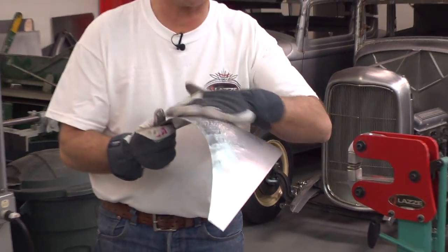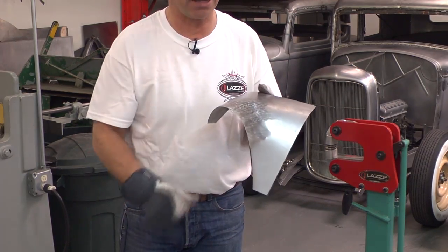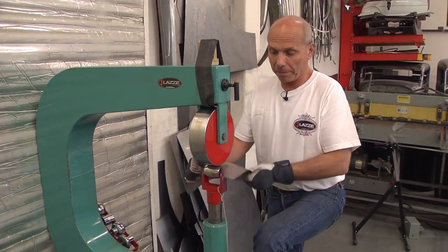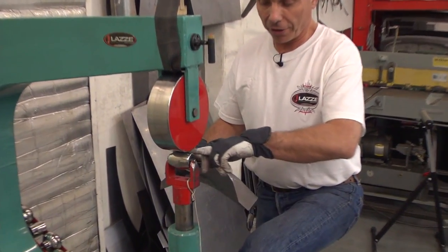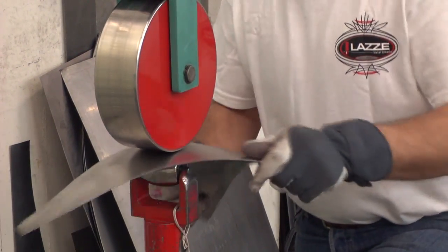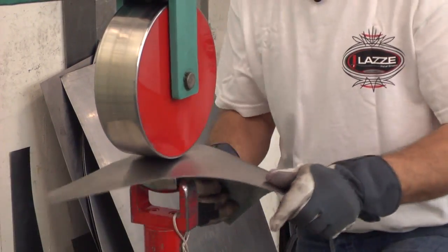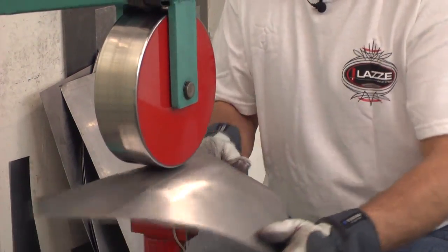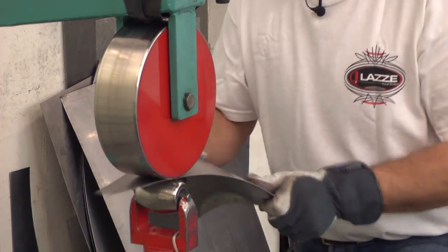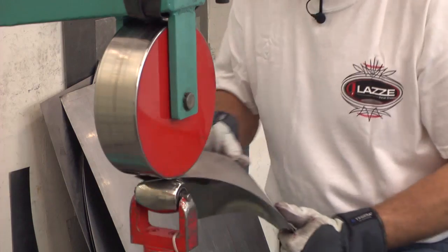You can see the surface is pretty okay there. If I go over to the wheel and smooth this out with a third wheel — without the rubber band — we can take a look at how that looks. I have a third wheel so I have more radius there. If the shrinking is not so smooth, you will feel more marks when you're rolling. I could feel that I could actually have shrunk it a little more smooth.